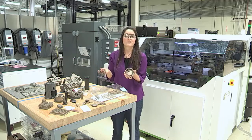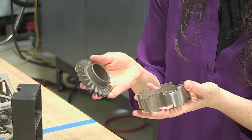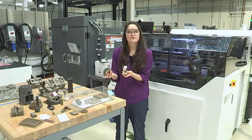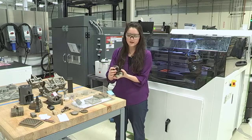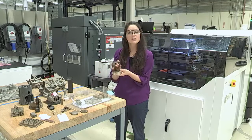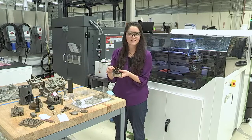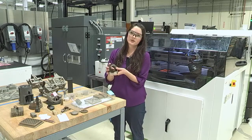So that's how we make fully dense metal parts using plain old low-tech inkjet technology. This is a really cool part — it's really difficult to get the tools into all of these crevices to get the desired shape. But with additive, this is an easy part to make. With additive, complexity is free. They found that by using this material system instead of the tool steel, they had an increase in tool lifetime from two weeks to six weeks, because the sand they were drilling with would get stuck in that bronze matrix and act as a sacrificial wear surface.